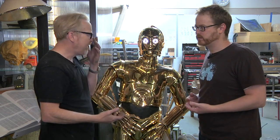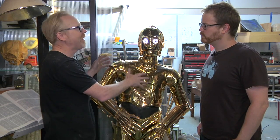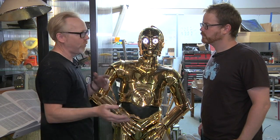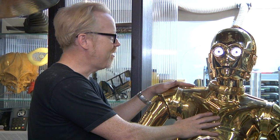And how does it look? It looks fantastic. Almost every tchotchke you see that's chrome-plated and has a color to it is vacuum metallized and done that way. And they have tremendous control over all sorts of fine finessing of those colors. This 3PO is vacuum metallized, but not in aluminum.